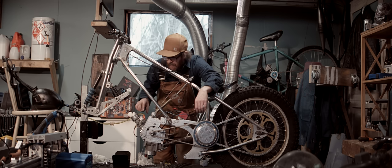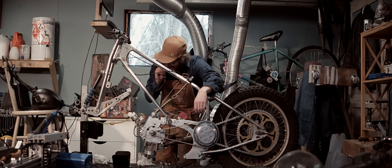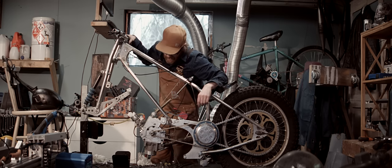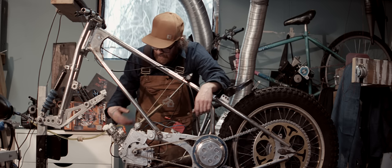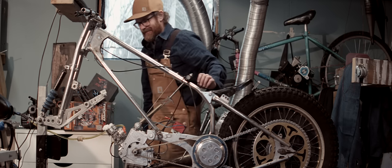There's probably a limit to how large you can make the crankcase and still get benefit from it, versus the opposite of benefits. It certainly makes carb tuning hard. We'll see if this makes it any easier. We'll probably have issues with this being an alcohol carb, because the engine is sucking much harder now below the power band, and we might have to change out the carb again. We'll see.